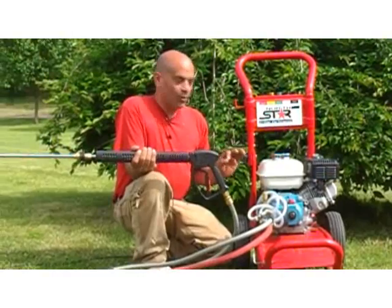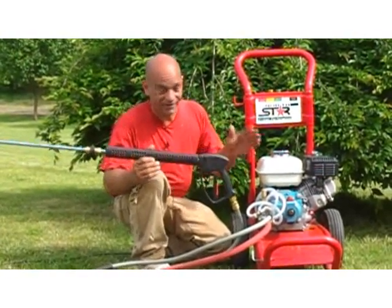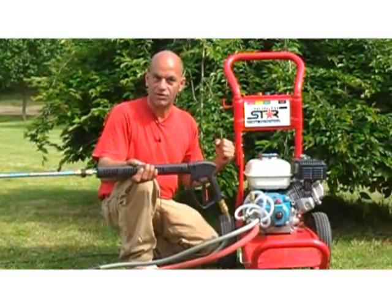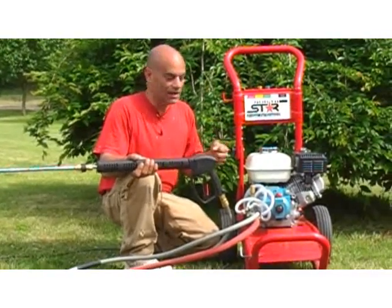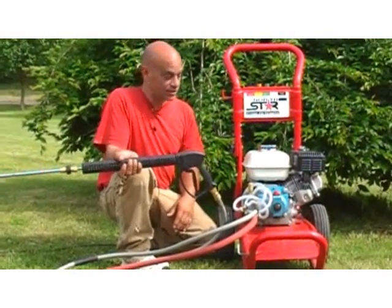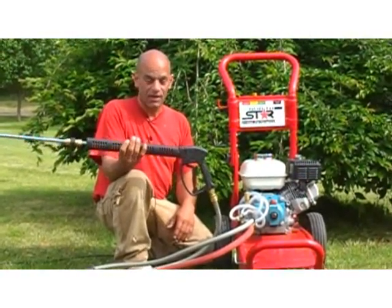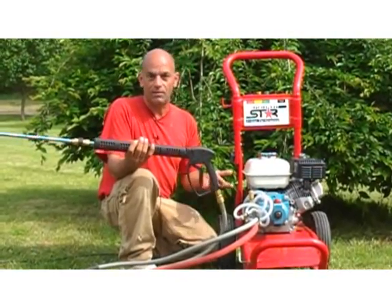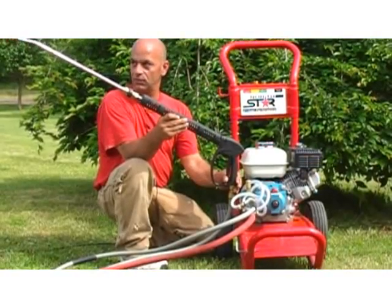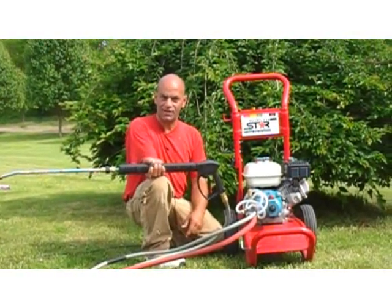Anyway, it's real important. Say you turn your power washer off because you wanted something to drink or eat or whatever, and you go grab the pull start handle on your power washer, and it's like a rock. Well, that's because you still have a lot of pressure built up, and the pressure will stay there pretty much. This one's been off now for probably about 5-10 minutes. Well, let's release the pressure. Well, you want to know what? My cameraman already released the pressure on me, as he's nodding to me.